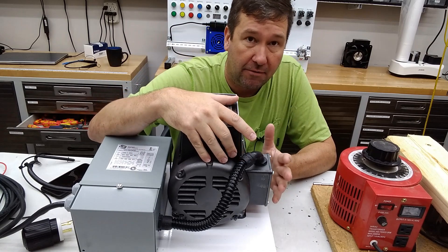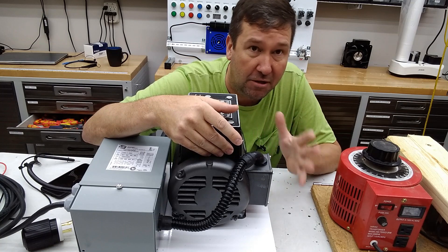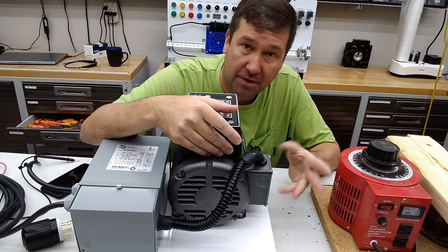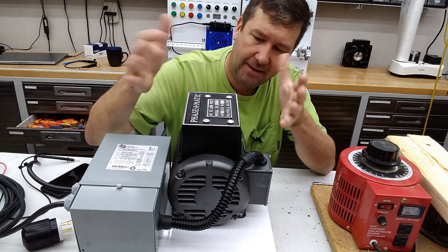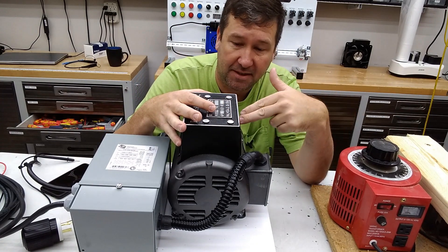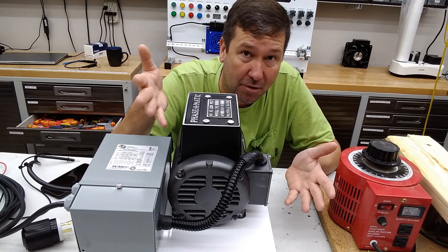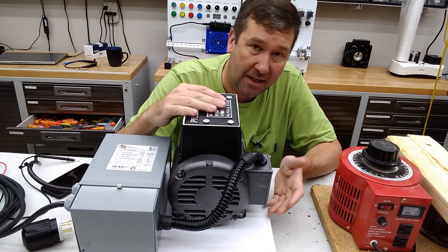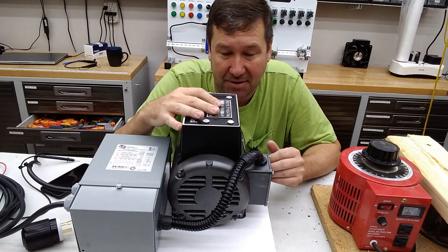Then we're going to feed that to the rotary phase converter. I've got a video and I'll put it down in the description — it covers how you can take any three phase motor and connect single phase to it. Once you get it turning it'll generate that third leg. This part has a starting capacitor, and that starting capacitor gives it the boost to get that motor rotating. Because if you try to power a three phase motor off single phase, the one thing they won't do is start. So that's what's in here, and that's going to give you 230 unbalanced three phase.